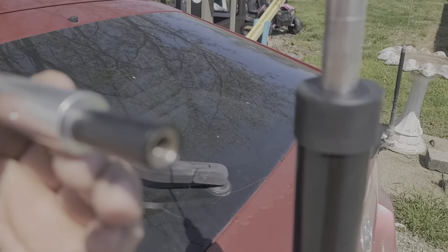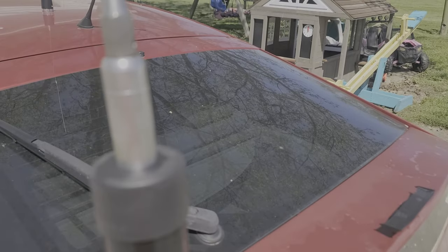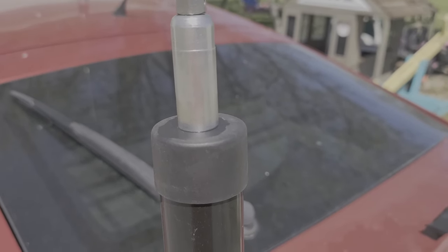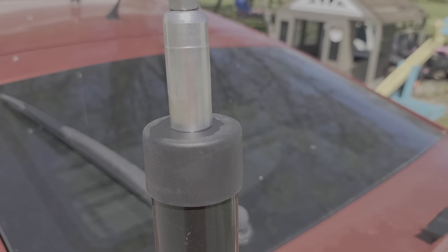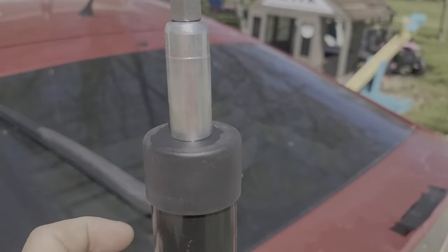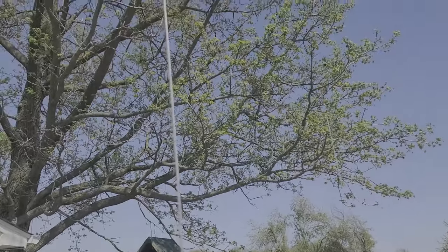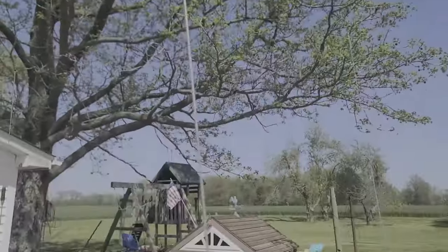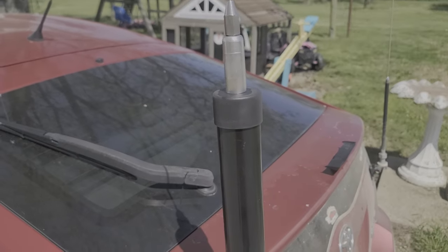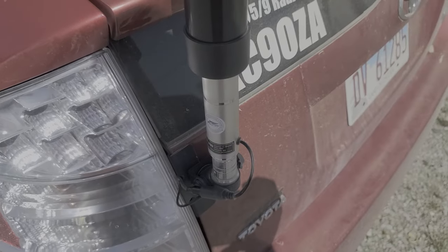I was kind of worried about the extra weight, and Ray mentioned he wasn't sure what the thread pitch was. I'd gone to several places trying to find it — it's close to 3/8-24 but just a little off. Ray figured it out and sent me one of these shorter adapters that screws directly into the antenna, and then you just put your whip on. I'm using a Wilson 62.5-inch whip and I've seen a little better performance with this over the telescoping whips. Overall I'm very happy with this antenna; I've not had any issues whatsoever.